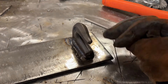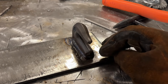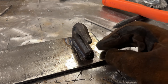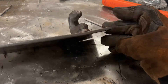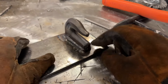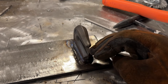This is assuming you're welding on three-eighths or up to quarter-inch plate. I think I did four or five passes total - that's what you want. On quarter-inch plate the warping happens because of the number of passes as the weld shrinks and pulls up. On three-eighths or thicker that wouldn't happen, and on quarter-inch you could probably just do a simple three-pass weld.